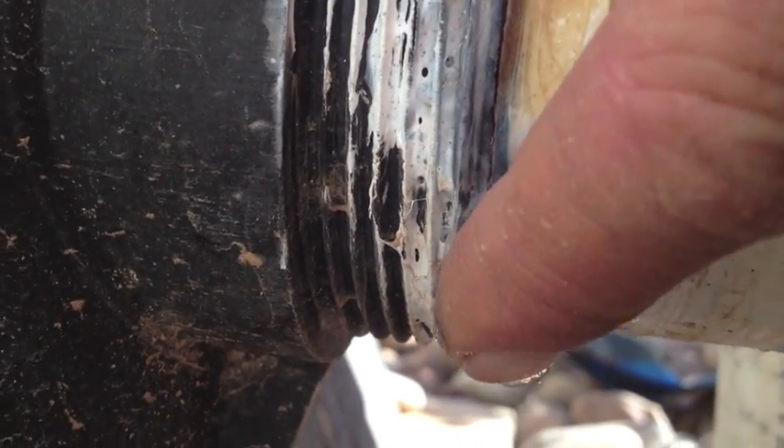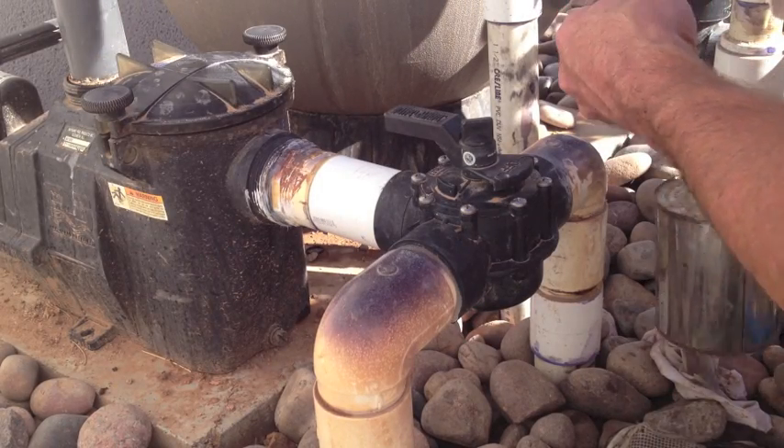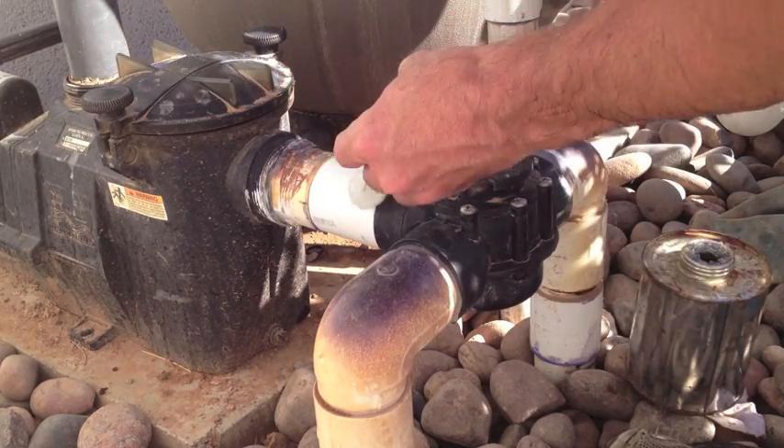Use CPVC as it's more heat-resistant. Here you can see a spot where all the silicone has been drawn in — just apply a little more. For added insurance, you can go over the plumbing joints with a fast-setting glue to help stop up any undetectable micro-leaks.